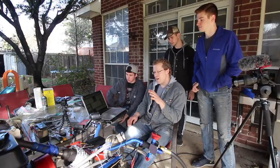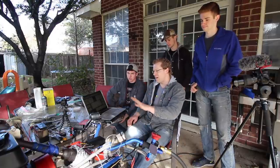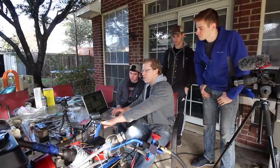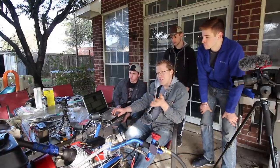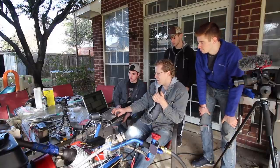The one where we got what I believe to be a good boost and an okay air-fuel ratio — enough to actually produce power. We couldn't get it at full throttle to make the right air-fuel ratio, so this is at part throttle the whole time. There's definitely room for improvement, but this is the best run so far. We're going to go ahead and replay it now and see how much we make.